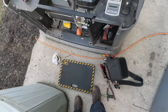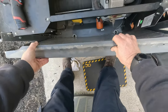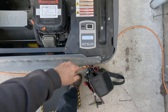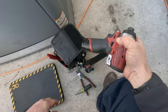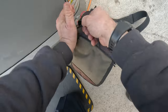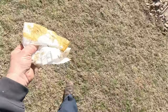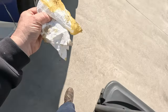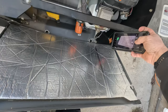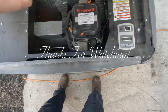Now if we put it to manual, it's going to trigger out. There it goes — low oil pressure. Yep, so that's the problem. It's back to the way it was. Most oil switches and stuff — it's just an extra set of precaution. If your oil level is fine, whatever. But when we got to play by the rules, we'll play by the rules. So that's going to wrap this one up, guys. We'll come back and change that oil switch however long it takes to get it. I've got to get information off the generator so we can match that up. That's what it is. Take a picture so they know what they're looking for when they go to order it. Good deal.